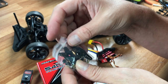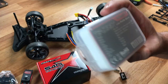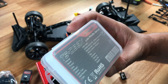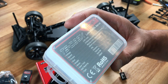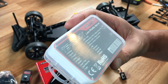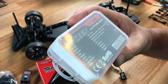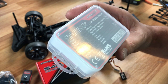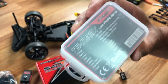I'm going to just use a standard plastic servo horn at this point — I'll probably upgrade that to metal at another point. Voltage is 4.8 to 6 volts. Speed is 0.09 seconds at 4.8 volts and 0.08 seconds at 6 volts, so not a big difference there. Torque is 8 kilograms at 4.8 volts and 10 kilograms at 6 volts. Size is 40mm by 20mm by 25.5mm, weight is 45 grams. It's a coreless motor, titanium gear train, dual ball bearings, and it is a digital servo.